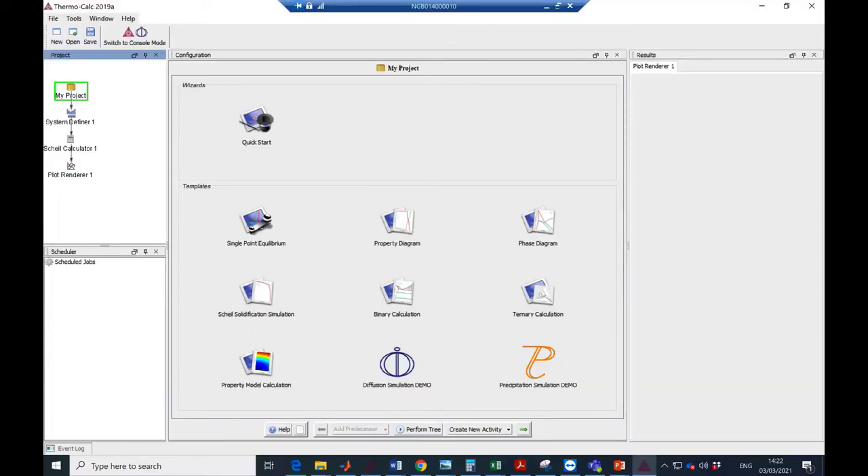Solidification is the most important physical phenomenon that occurs during additive manufacturing. To control additive manufacturing processes, it's necessary to predict solidification characteristics. This can be done via the Scheil calculator, which is one of the applications of ThermoCalc software. In additive manufacturing processes, solidification typically occurs under non-equilibrium conditions — in other words, the cooling rate is too high to allow time for complete redistribution of alloying elements according to equilibrium. This means that equilibrium calculations may not always provide a good representation of the state of a material following solidification. The Scheil-Gulliver equation, and its derivatives utilized by the Scheil calculator, account for the reduced diffusion taking place in the solidified structure in a relatively simple but efficient manner, providing a better estimate of the actual state of the material following solidification.